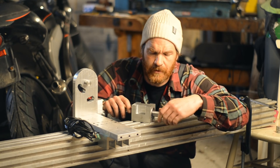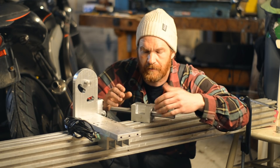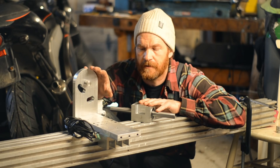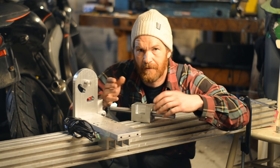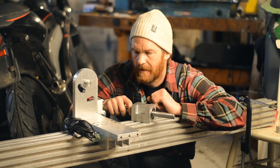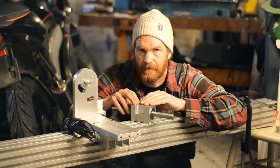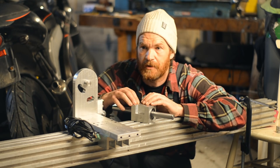Shipping these days is terrible, and the best would be to machine some pulleys and not have to wait for them. Now I'll have to wait for the cylinder anyway, so I can't really use the dyno. I've ordered some normal pistons and there's no reason this engine won't start and run now because everything's kind of normal. Then we can start experimenting with the methanol and nitromethane secondary intake injection system. And alongside this, we will be developing and testing a new concept engine with a blower and a rotary exhaust valve — I'll bring it inside and show you the latest iteration, and I think I've made it machinable in my mill.